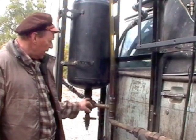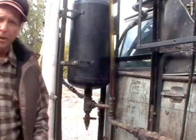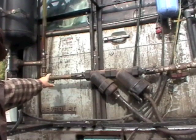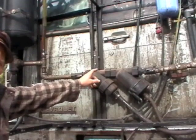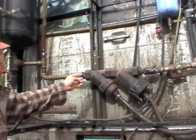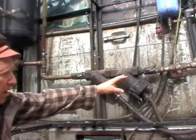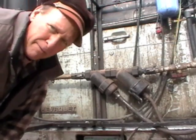Coming off from the T, the settled waste oil goes through this piping to the Y-traps. From the drain area of the processing tank, I go through a valve that I can open and close depending on whether I'm in drain mode or filtering mode. Through this valve, the settled waste oil goes through two Y-traps — they are two-inch Y-traps. The first one has a 30-micron, or 30-mesh, screen in it. The second one has a 120-mesh screen. They go along here through this piping up into the 20-inch bag filter.